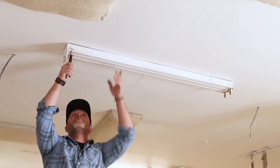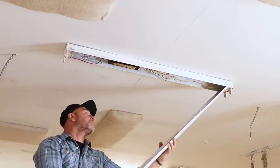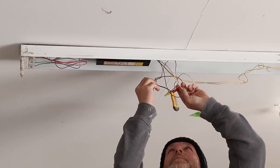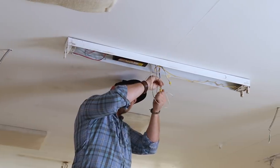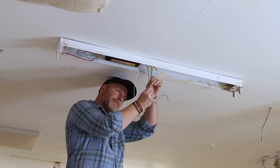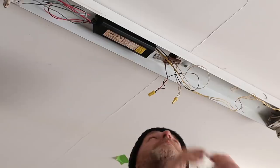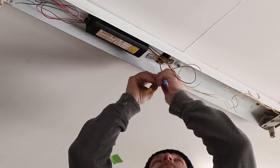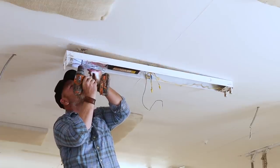But let's say this didn't work and we have to bypass the ballast — super easy, let me show you how. The next example is going to be the dual-ended ballast bypass. After removing the bulbs, you want to take the fixture cover off, which is going to give you access to the ballast and all of its wiring. Make sure that the power is off to the lights and double check it with a meter if you have one. Before doing any wiring, I always mark the power wire with a piece of tape — this way it makes it easier to remember which wire is your load coming in.